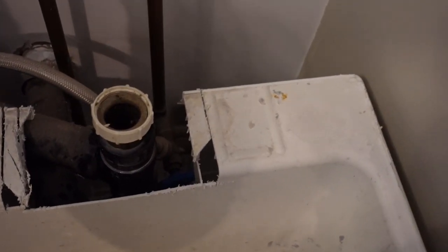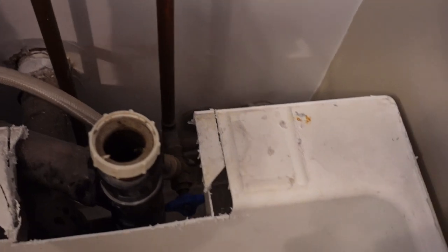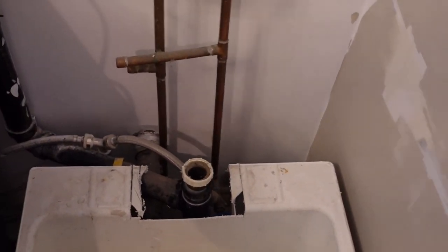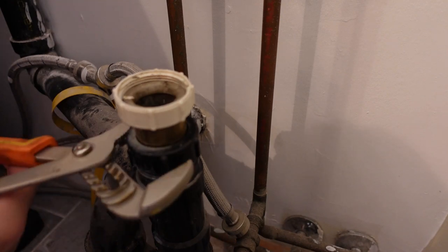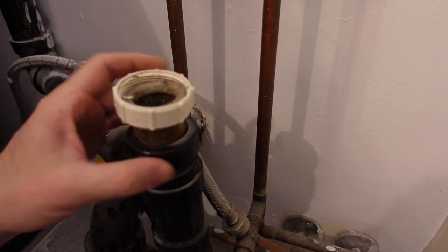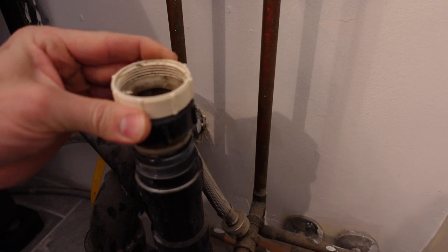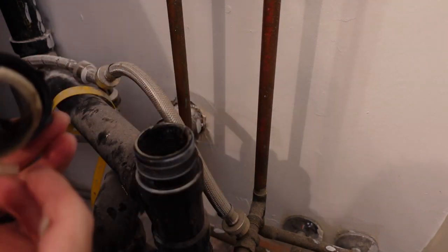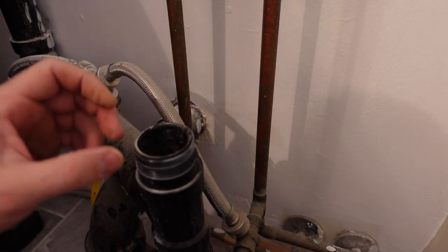There are also no shutoffs at the taps for this so I'm going to have to redo that as well. There are shutoffs for the washer and dryer but they're on a T. To get the tailpiece out there is a coupling and a tapered washer, and you can see the tapered washer is all broken apart — so before you start doing anything like this you might want to get some new tapered washers just so you're ready when things fall apart.